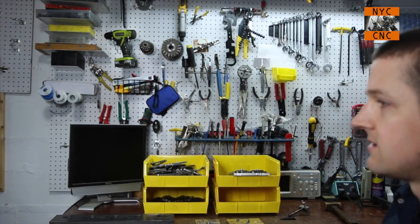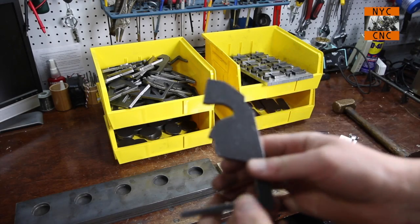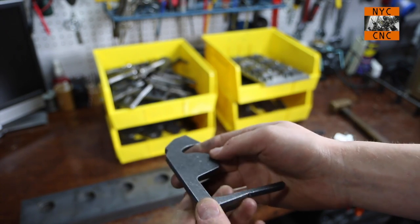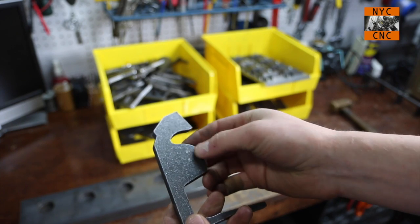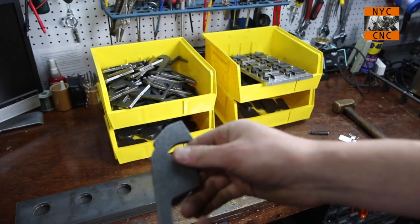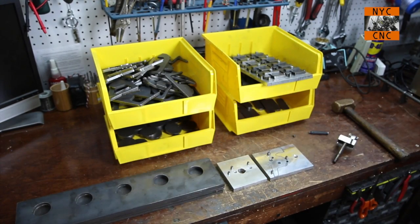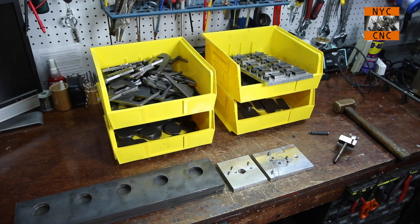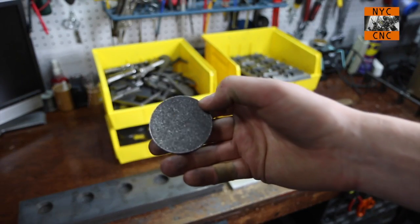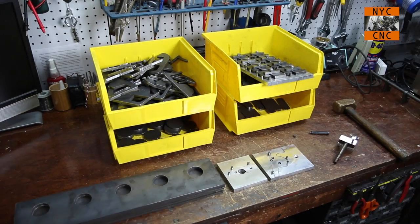You can see here I've got a bunch of inventory bins. Let's talk about those parts. Here are some bins of parts that came off the plasma, but I have gone ahead and done a post-op on them. You can see they've got a nice finish. This took me a little while to figure out, because with plasma you will have dross or a rough edge around them. You certainly don't want to have to touch each work piece grinding it or deburring it. So what I figured out is a way to tumble them — I just throw them all into a big industrial tumbler and let them bang against each other for about an hour. They turn out really nice; I've been really happy with the quality of the surface finish. Knocks all the edges off and does the trick well.